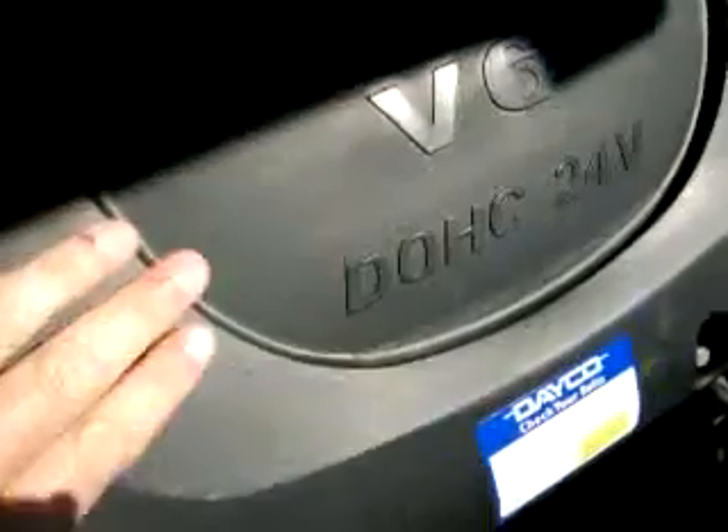Right, that's it there — I'm trying to get out of the light a bit. The cheapskates have put a bloody zip tie on it and haven't even cut the end neatly. They put a zip tie on it and it's starting to drip oil down inside all those castings, which I think is directly responsible for the little drip I see underneath. Later I'll get the cover off and have a go at getting the zip tie off, cutting the end of the pipe neatly, and putting an actual hose clamp on like it should have.